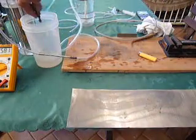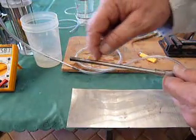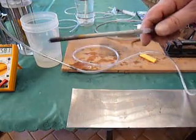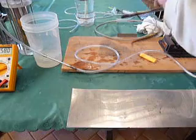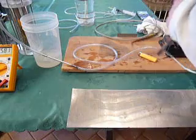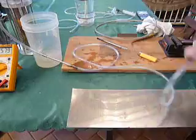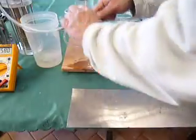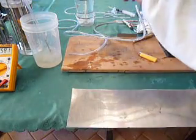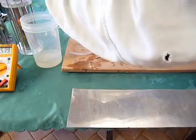So it got pretty hot — it was burning inside the tube. You can see the way it's burned down through — back to probably about here. It didn't flash back; the flame didn't get back to here. I kind of like that protection, but I don't want to be using that because it provides very little back pressure to the system.